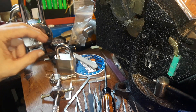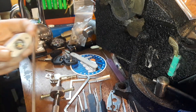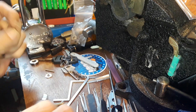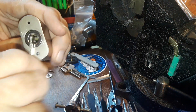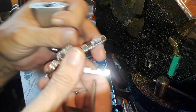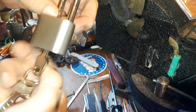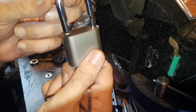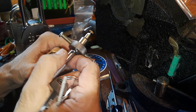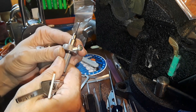They're so cheap — that's my only complaint about them, and this one's got the same kind of core. I'm not going to pop it loose because I already know what a disc detainer looks like, but I will try to pick it with this little chinesium set here. To 'zero it' — what I mean by that — these are the keys for this particular lock. When they're in there, it frees up; it's got a ball bearing locking mechanism, which is pretty good — can't be shimmed. Not everybody carries disc detainer tools around with them. Even if a person's got a pick set, they probably don't have one of these on them for everyday carry.